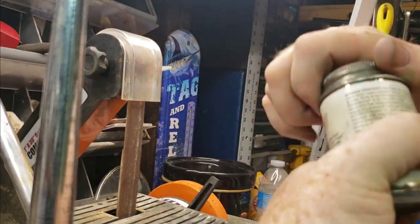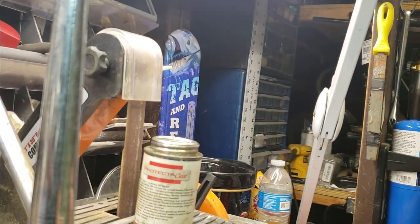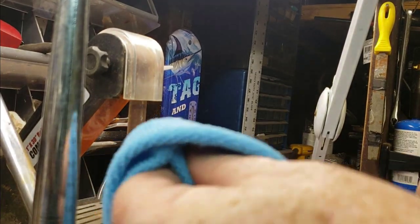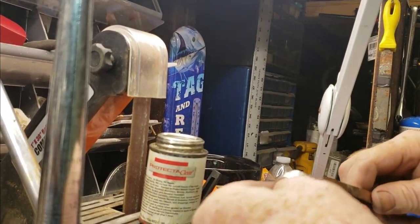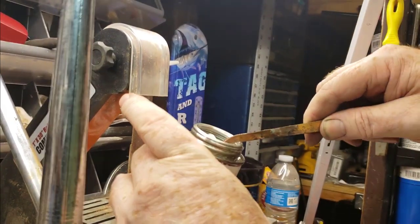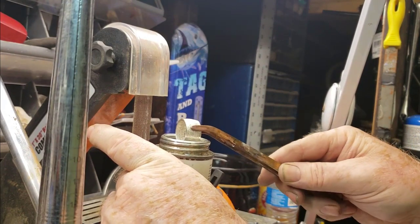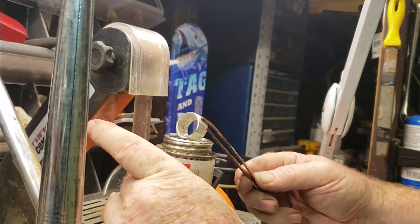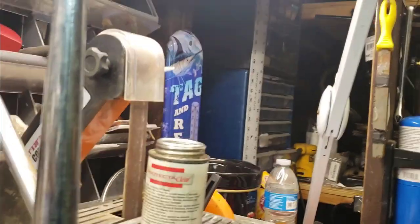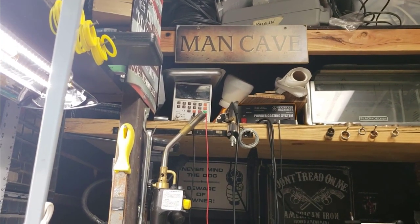Because this customer wanted straight silver and no antique patina, this is exactly how he's going to get it — the natural silver. I'm going to dip this one in Protect Clear. After you give it a good soaking, go ahead and hang it up on a nail at an angle on the side of your wall so that it runs off the sides — all that extra drip so it doesn't stay thick on the sides. And that's it — you're done with your ring. Just got through making a beautiful pirate pieces of eight.